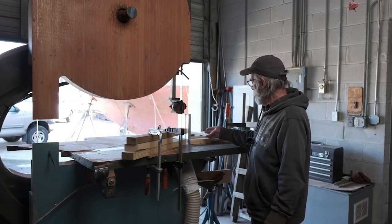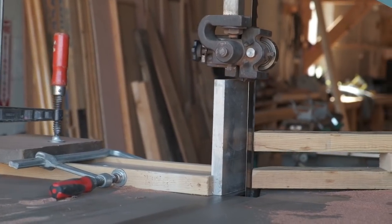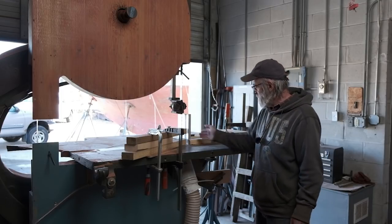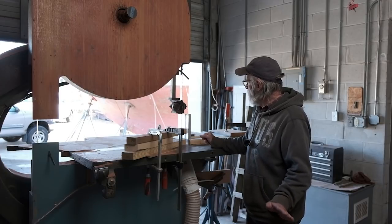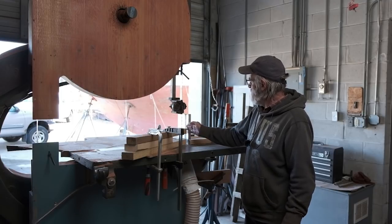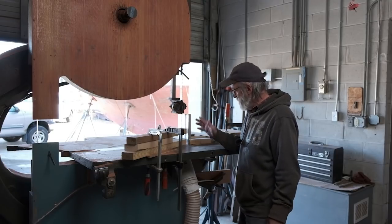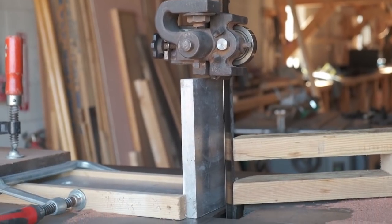The other thing I want to show you is the fence. We don't have a big long fence on the table here, and really ripping with a big long fence like a table saw doesn't work well on the bandsaw. A bandsaw doesn't like a fence that parallels the side or is 90 degrees to the front of the table, because you really need to line your work up with the blade. The blade is not lined up with the table — it comes off the wheel and goes through the old antique guides at a little bit of an angle. So when I set a fence, I have to sight the blade and make sure I know what angle it's on and put the fence parallel to the blade.